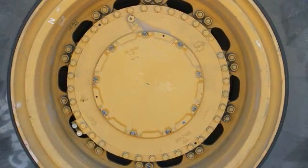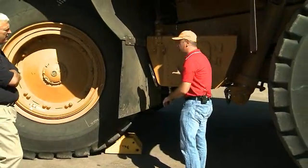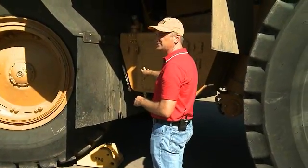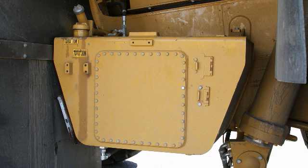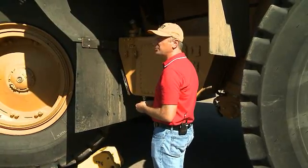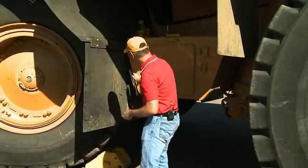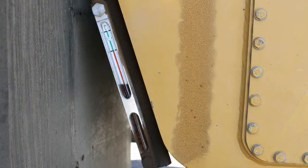Those changes are carried through to the rear wheels as well, with the exception of reverse flow, which was already on the rear wheels. Coming around to the hydraulic tank — we've separated out the torque converter and transmission circuit. They've got a separate sump that's part of the torque converter housing now, so the hydraulic tank is strictly brake cooling and hoist brake actuation. This is a prototype, but this is a sight gauge for that torque converter sump so the operator can quickly check the sump level during walk-arounds before starting the machine.